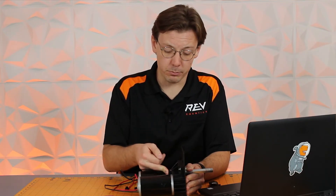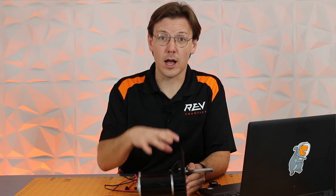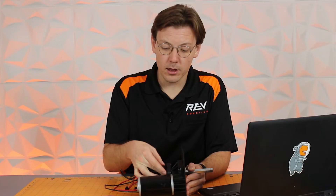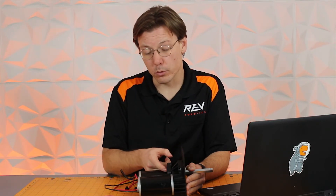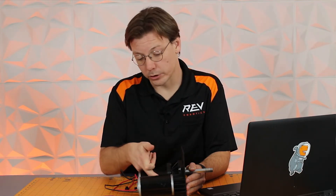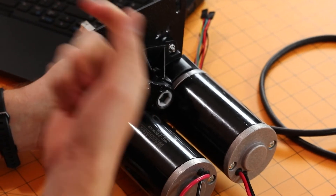After you get it started and it's on a little bit, you may need to use a hammer or something else to press the bore all the way down. You want to make sure there is a snug press fit so that there are no ticks and no loss on the encoder itself. When you go to mount the encoder you may need to spin the encoder output a bit and press it down and in.